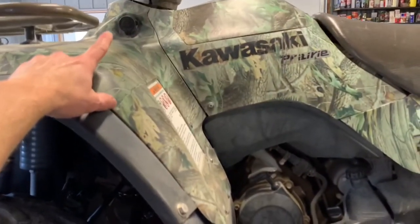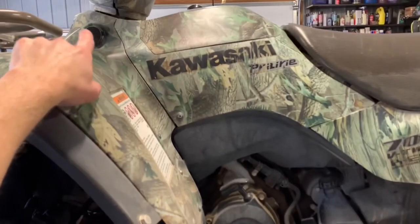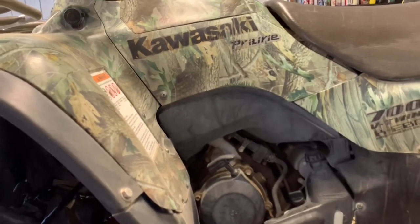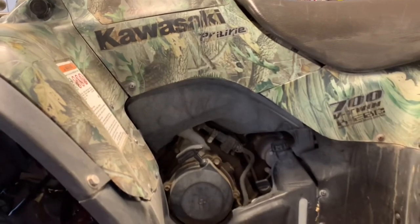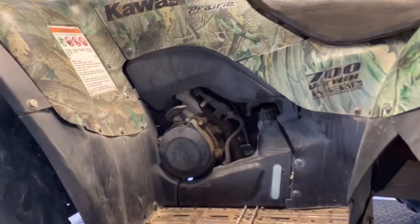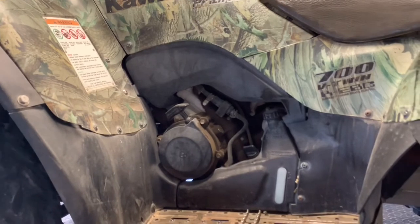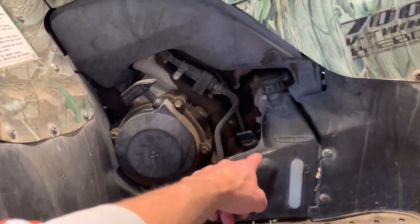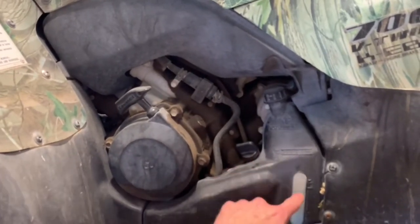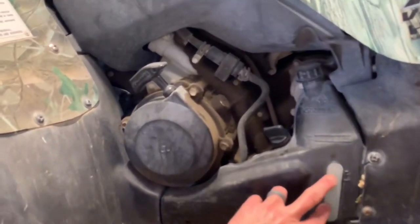You've got an auxiliary plug up here to the left of your rack, in front of your air filter. That's great for a cell phone charger, spotlight, or any power equipment — if you've got a sprayer, you can run it off that auxiliary cord. On the left-hand side, you've got a recoil pull starter, which is nice to have if your battery is low. Your dipstick and fill plug are here. This whole area is your coolant overflow reservoir — it's got an L and an F mark, so make sure your coolant level stays between those.